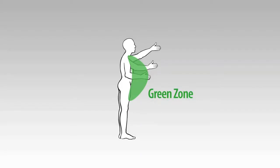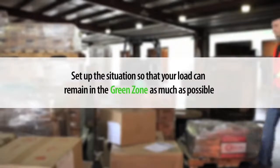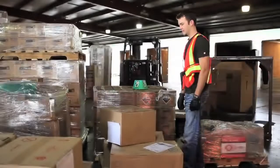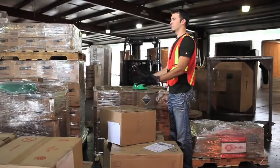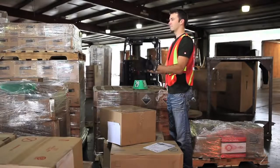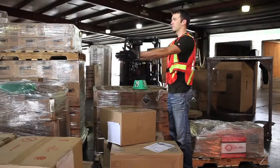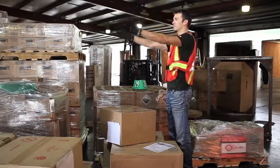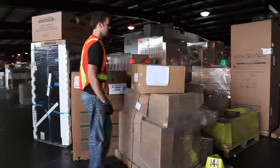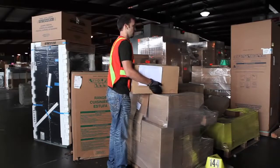The green zone is where the load should be placed around your body so that you are the strongest and your body position can support a safe lift without injuring yourself. So when you plan your work, one of your goals should be to set up the situation so that your load can remain in the green zone as much as possible. Specifically, the green zone is defined by the arc that your lower arm makes when you stand upright with the elbows close to the body and you bend your elbows from this position. When lifting loads in the green zone, you'll be able to walk right up to the load and lift from your strongest position using the lifting basics.